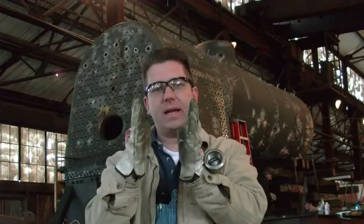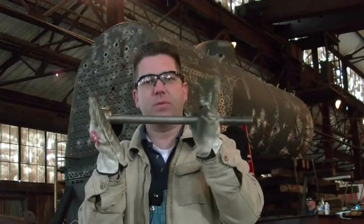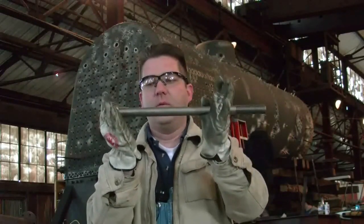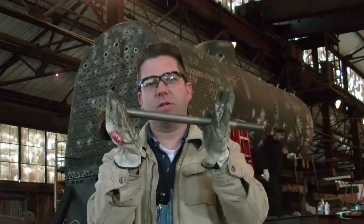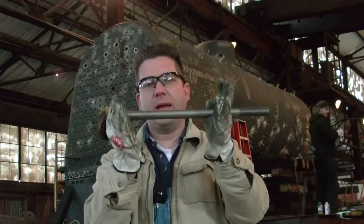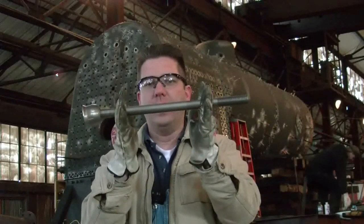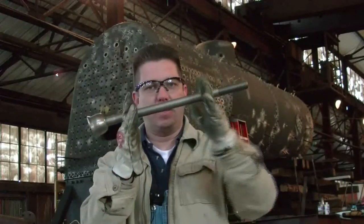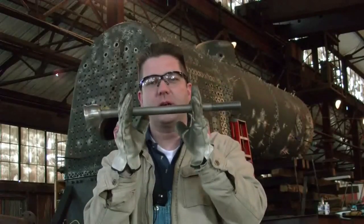When those inside sheets heat up, they're going to have a tendency to want to start to move. This hand is the one subjected to the fire, and those firebox sheets start to move like this. Without a flexible bolt, what we end up with is a rigid stay bolt that can't move — but it has to move because it's subjected to the movement of the firebox side. Eventually what's going to happen is the stay bolt itself is going to break.